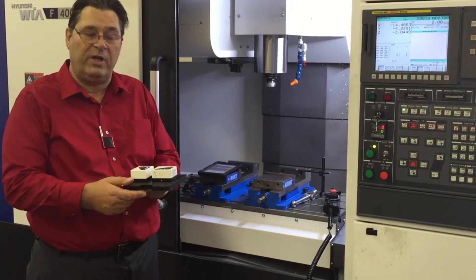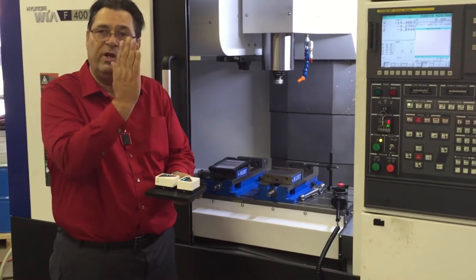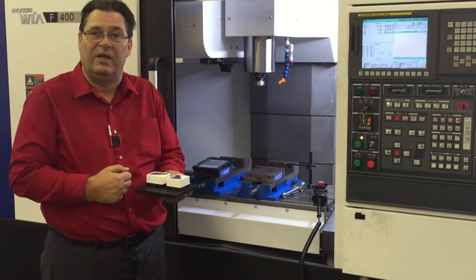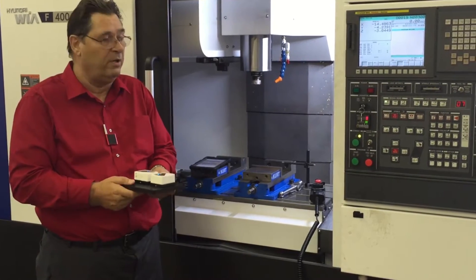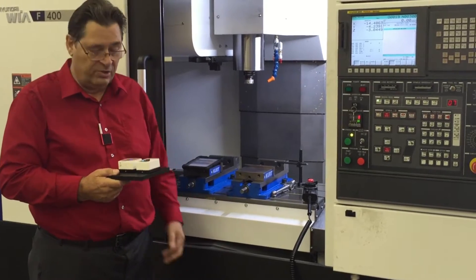So we can make both adjustments at the same time. I'm going to place it in the machine, take a reading, rotate the plate 180 degrees, take a reading — it will establish earth level. I will then do it again for the second level. Once completed, we can take the iPad down to the jacks and make the necessary adjustments.